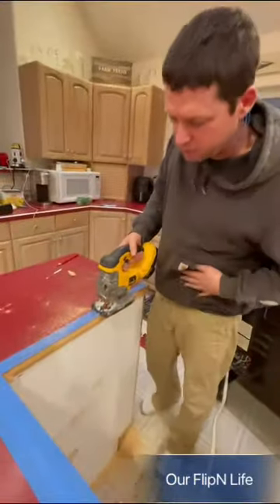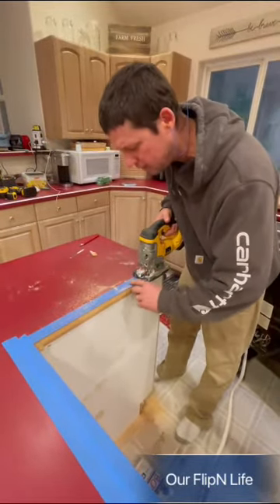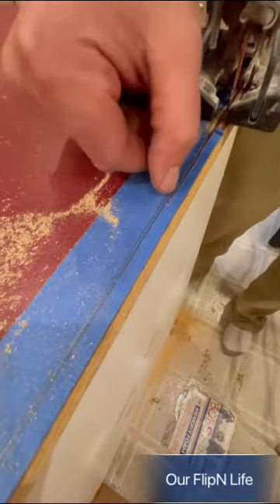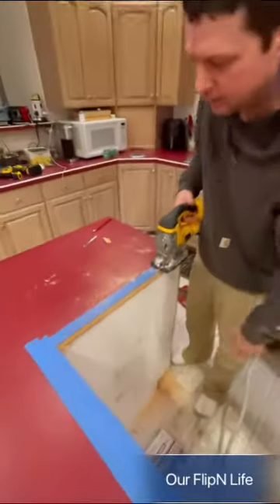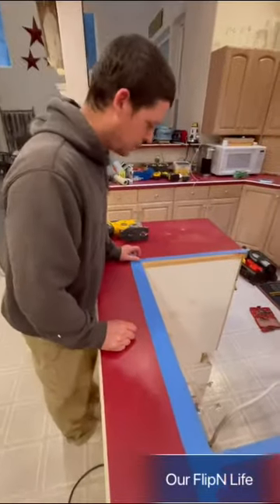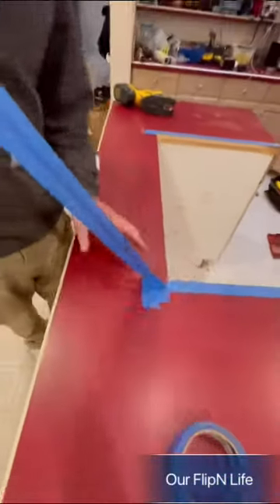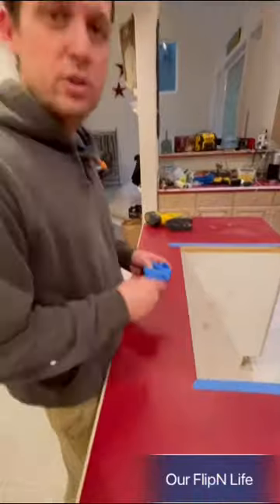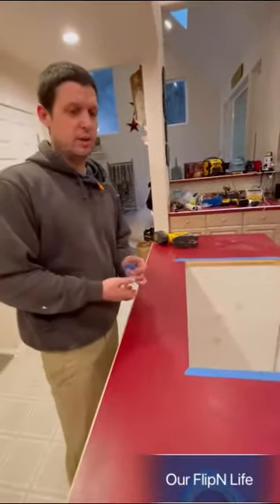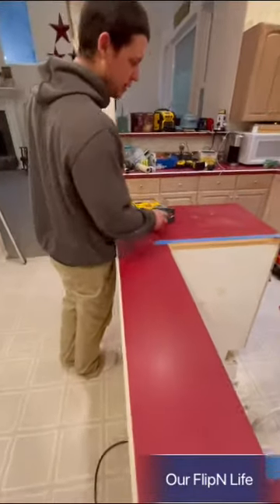As I'm going I'm blowing that dust out in front of me so I can see the line. What I like doing is leaving my line — I'm cutting just on this side of it so I can go right down it and make a perfect cut. See that — no chips. If you don't use the right blade it'll ding that edge all up and look sloppy. You can use a router bit or one of these jigsaw blades, but make sure it's cutting on the down swipe.